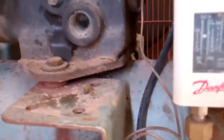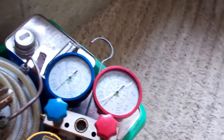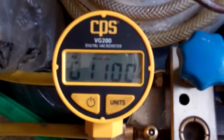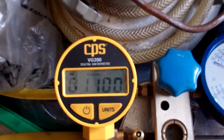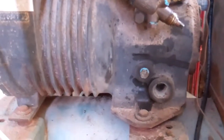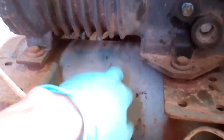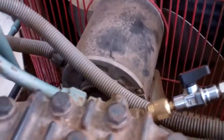The synthetic ester oil will be better with all the newer gases, depending on what we run it on. I don't know what's in there and I don't know if there's enough in there to run it, so we'll see. We've had it on vac for a bit and got it down to 1100 microns - might go down a bit more. Considering this was full of refrigerant when we started and this side still has refrigerant in it, if one of these valves is letting by even a tiny bit you won't get a deep vacuum.